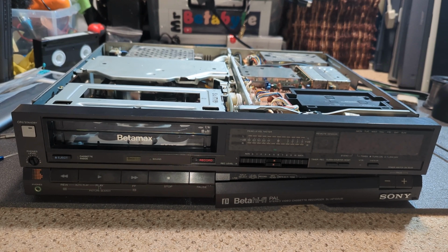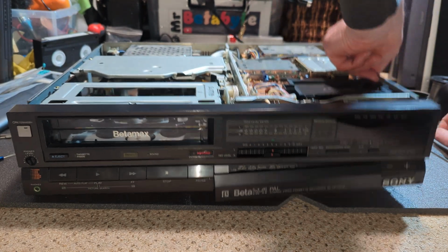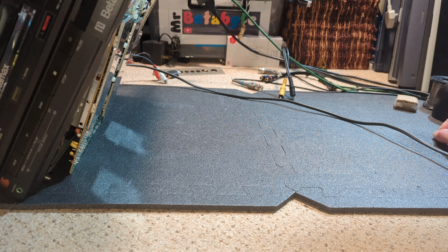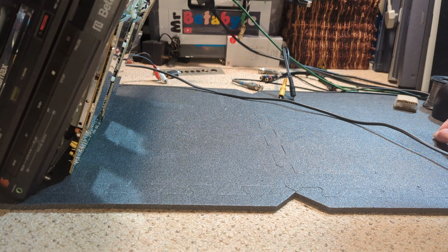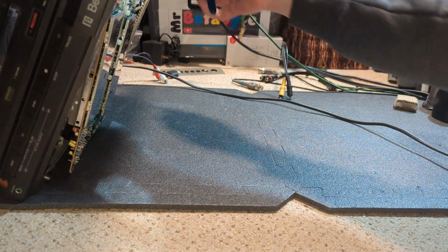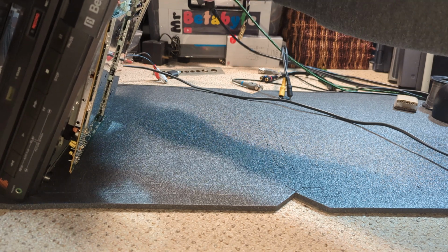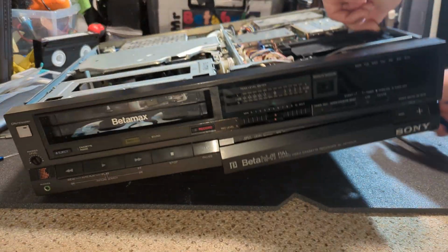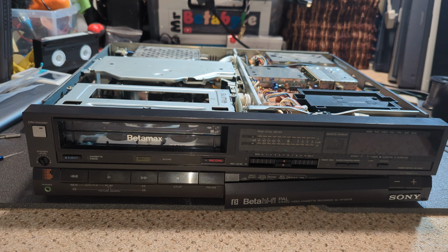Okay, so this should be interesting. I did double check that all the caps are put in. I did get the polarity right, and I also made sure that all the leads are properly trimmed, so nothing should touch. I can see two I missed, so let's just make sure we've got no stray bits underneath there. You probably didn't see that, but anyway, I've done it. So if you hear a little pop and see some smoke, you know why. Okay, so let's plug it in.